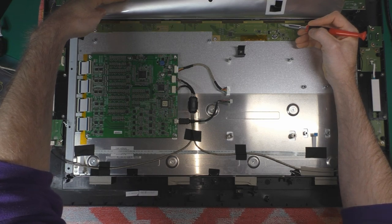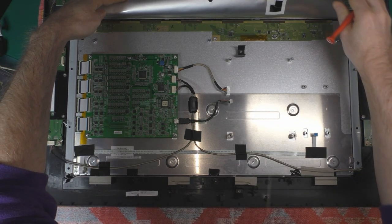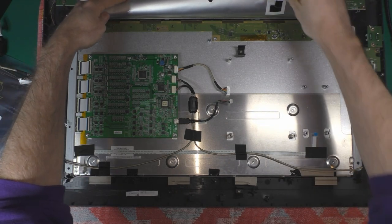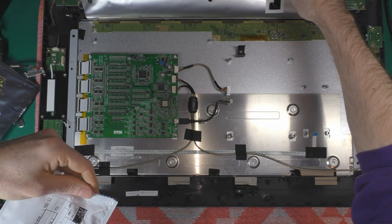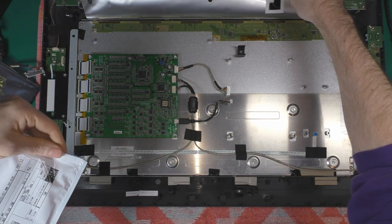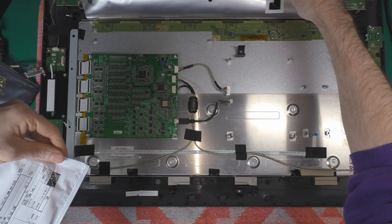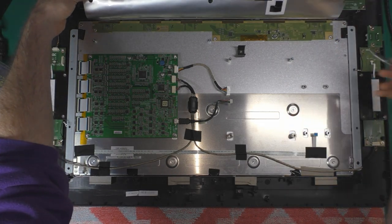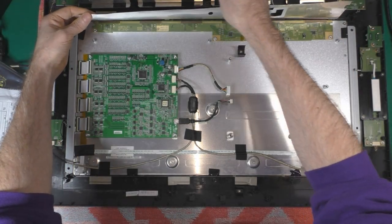But anyway, I'm going to change the big ones, which are present here. This is the ceramic one I bought on DigiKey. I think they are 10 microfarad. Let me check. Yeah, it's 10 microfarad for 50 volts. I'm going to put the link in the description anyway. And yeah, I hope this is not going to be problematic. I'm going to zoom in at some point and service the capacitor as best I could.